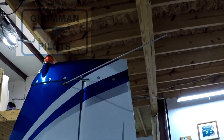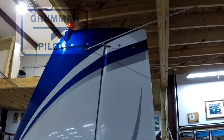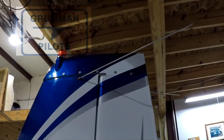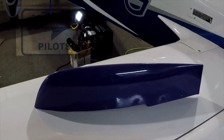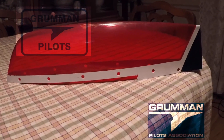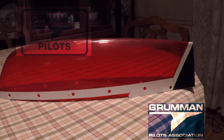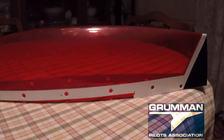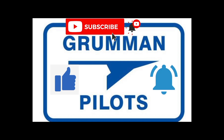Good morning ladies and gentlemen and welcome to the Grumman Pilot YouTube channel. Today we're going to talk about your lighting options for LEDs on top of the rudder tip. Most rudder tips have a jelly jar on top as the anti-collision light per Part 23 certification. Your options are: keep the jelly jar, use a faired end cap with a combined tail and nav strobe, or use a red rudder cap. Please subscribe, hit the like button, and hit notify to stay current with our content.